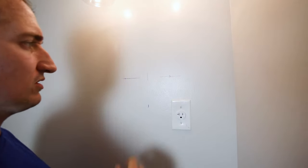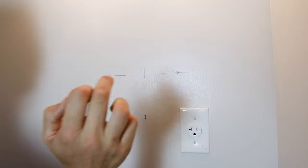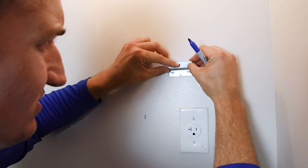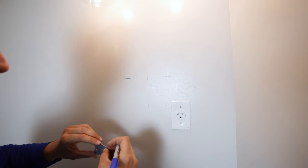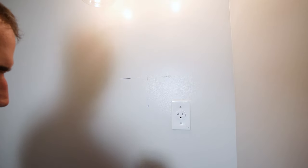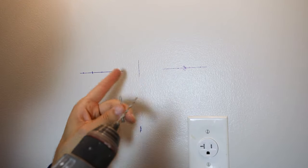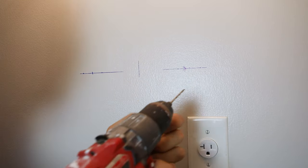Now I know where my brackets will be centered. I'll put the brackets in — I know there's a stud back there so I can screw right into it. I line the bracket up to my level line, roughly center it, and mark the screw holes. The mirror has some play so it doesn't have to be super exact. I pre-drill holes with a drill bit slightly smaller than the mounting screws. Since I have blocking in there already, I'm going straight to the wood — no drywall anchors needed.